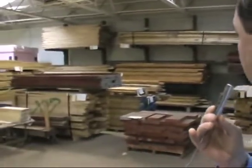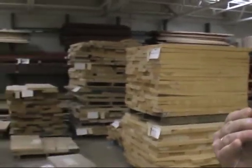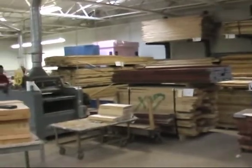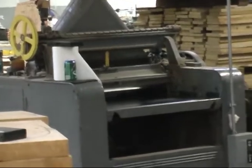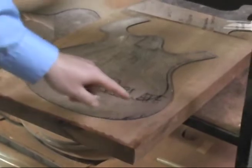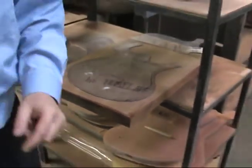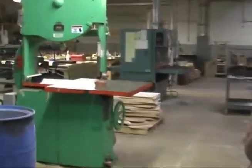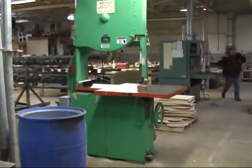We're back here in the Parker Factory. Behind me is where the wood is brought in — it's aged for quite a few months. After the wood is aged and ready, we put it in the planer to get it to the exact thickness we want before it gets cut. Then we place this plexiglass template on the wood, draw the Fly Guitar shape with a pencil, take it to one of our band saws to cut out the Parker shape, and from there it goes to the CNC machine.